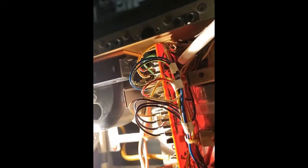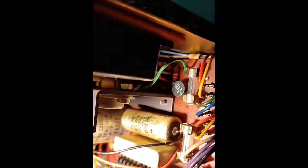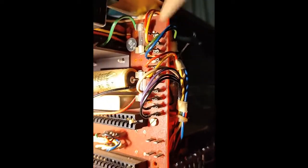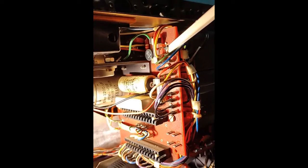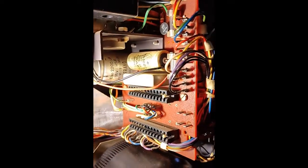The other line for 21 volts has two black wires on the back from the transformer. These go through this fuse there, through this bridge rectifier, and with this capacitor and some other components, they reach these two plugs which give 21 volts DC.